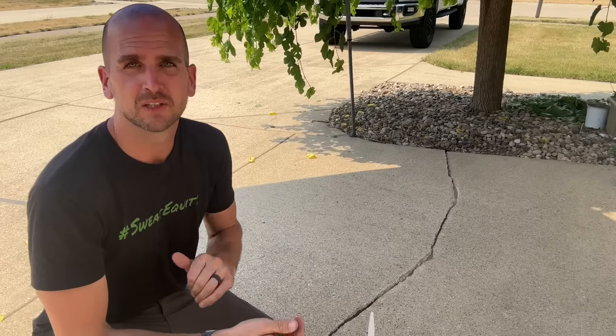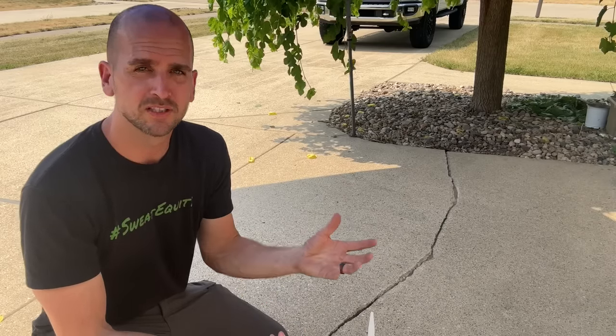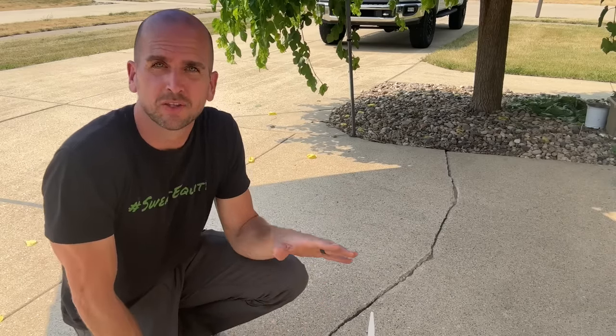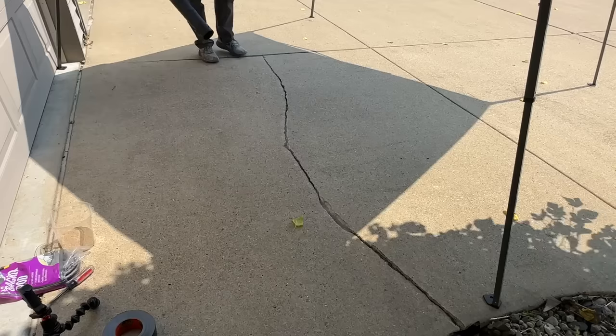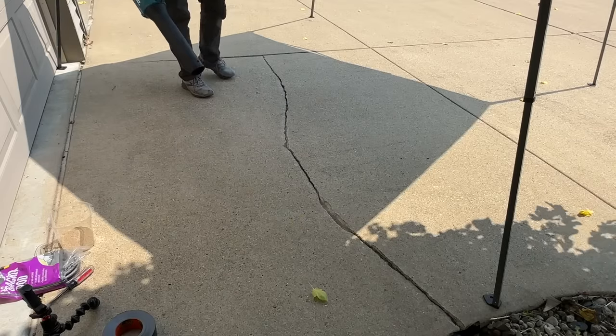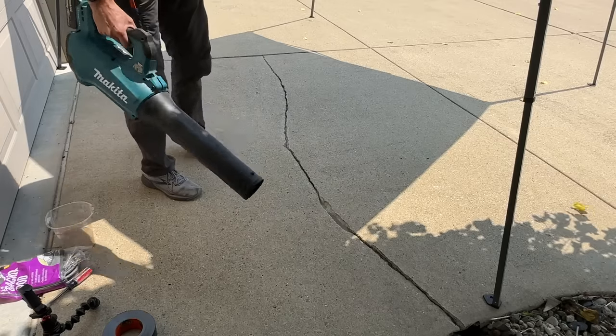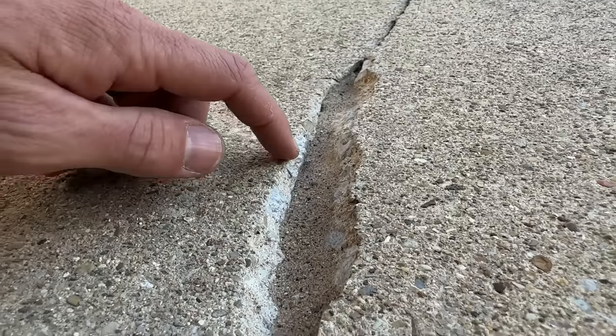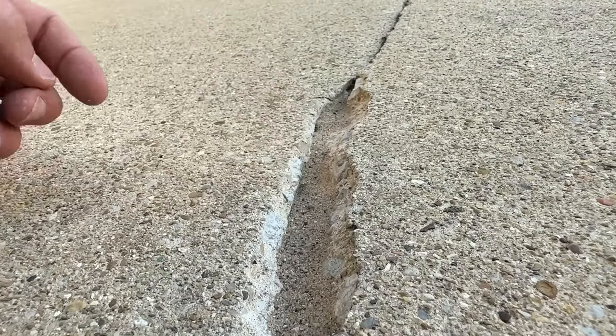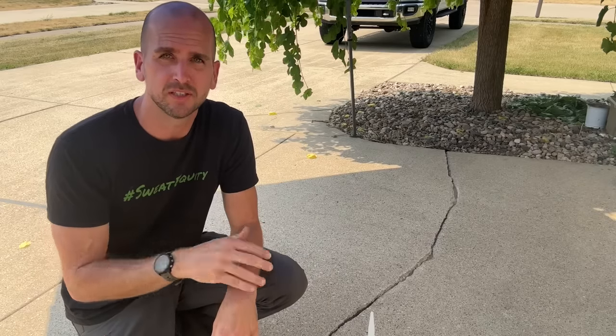And then even that nylon brush to prep the concrete surface before applying your sealant. Since we used quite a bit of sand, I did go back through with a quick nylon brush pass, then used my leaf blower on a very low setting to blow off all the surface sand — resulting in the two edges on the left and right being clean concrete so the Tremco sealant can bond properly and give us a long-lasting hold that will hold up for years.